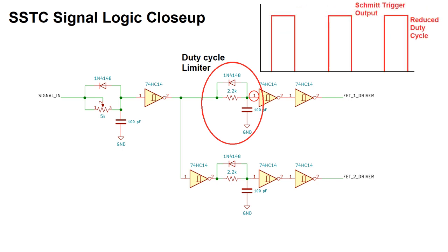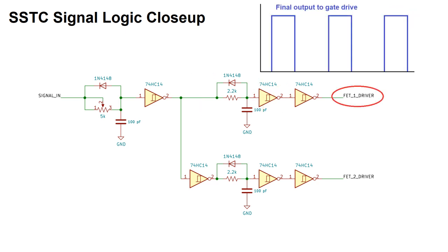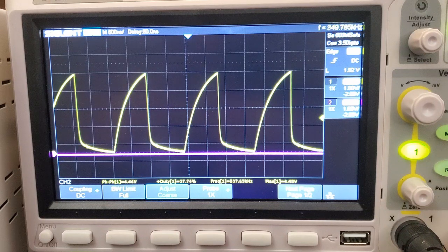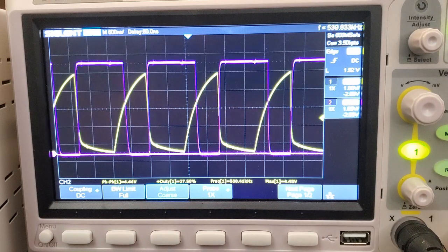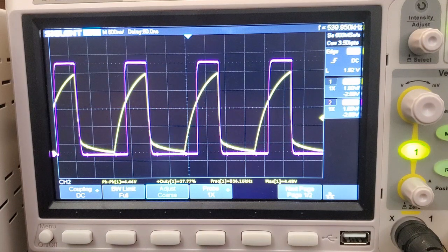In this case, the trigger is also an inverter, so it makes the duty cycle longer than 50%. To fix this, another trigger simply inverts the signal again, and I get my output with a reduced duty cycle. Let's see how that looks on the scope. In yellow is the RC delay voltage going into the inverting trigger. In purple is the trigger output, and if we invert it again, we get our reduced duty cycle square wave